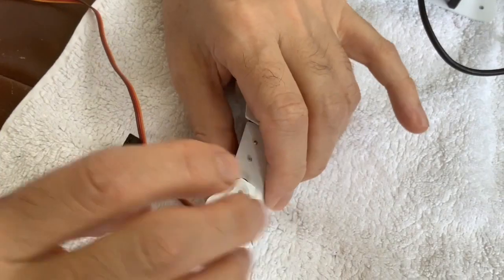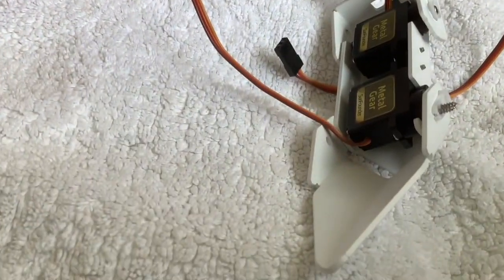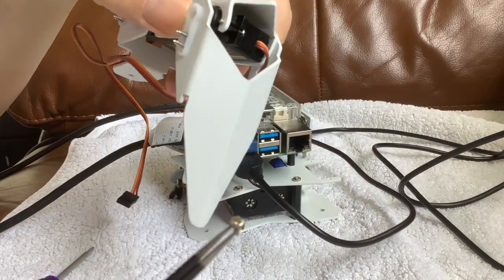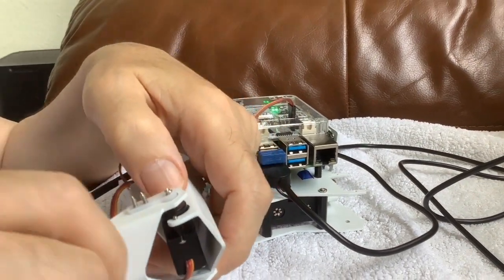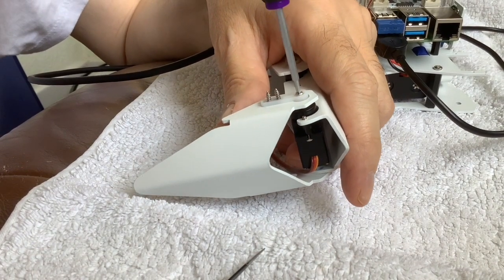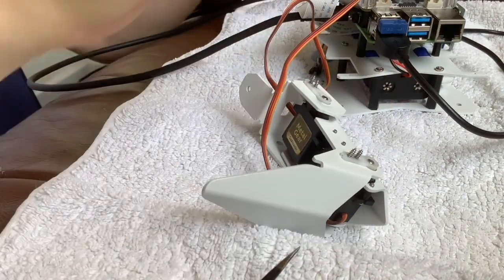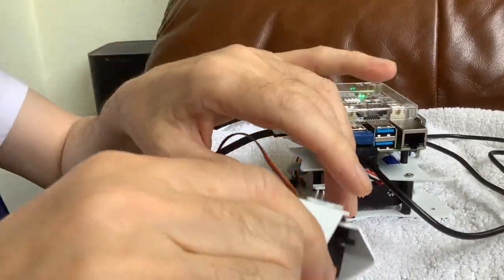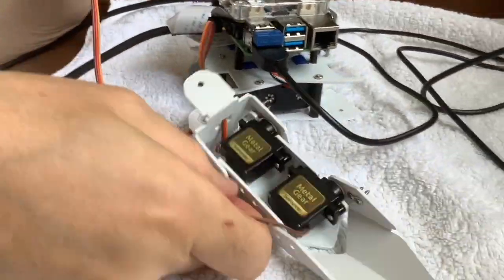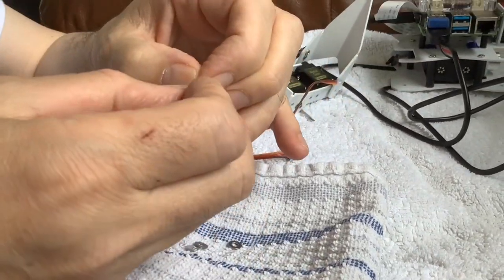Touching the foot now, Paul. You're zeroing the servo — zero the servo. And then we turn it 90 degrees, because it's not pushed down properly on the servo, so it moves until you put the screw in. When you put the screw in, it pulls the arm down onto the servo splines and it locks in position. You've moved it now, and now you're plugging it back into the Raspberry Pi — and hopefully it moves it back to 90 degrees. And it did.